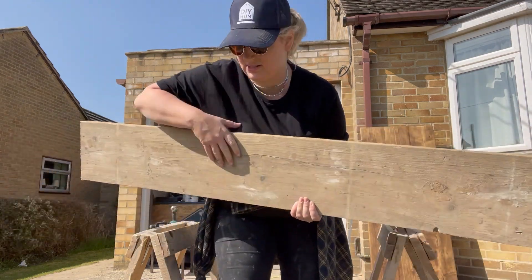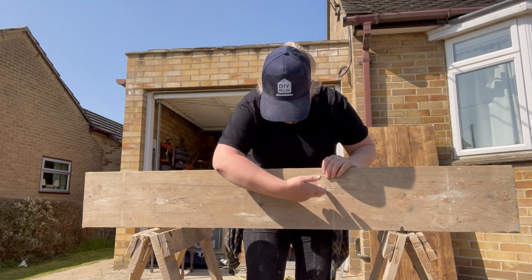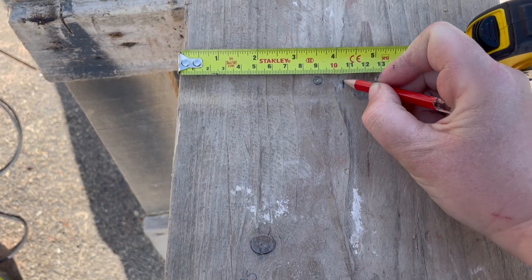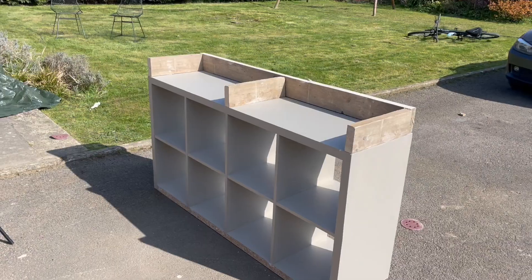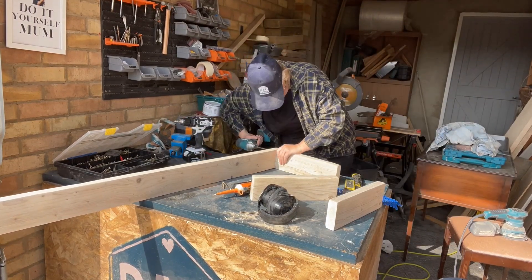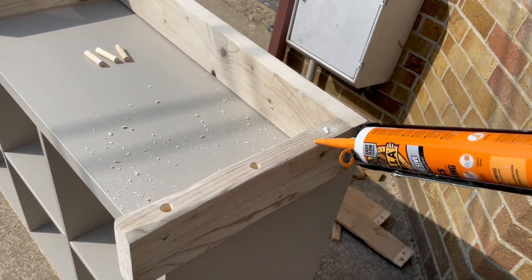I've measured 147 centimetres and cut to size. I'm not going to have a drawer this wide, so I'm going to cut the scaffold board in half — that will give me the height I want for my drawer. I've cut down all the sizes: one long length at 147 running along the back of the Kallax, and three shorter boards — two for the sides and one for the middle to partition the two drawers. I'm attaching them together first using glue, wood screws, and dowels for alignment, and I may add internal brackets for extra security.